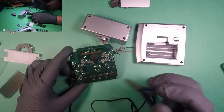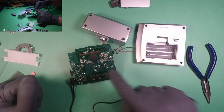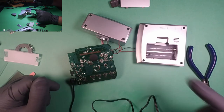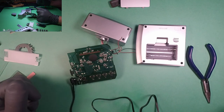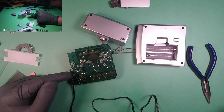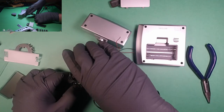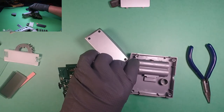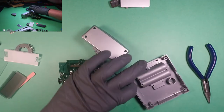There's no 1.5 volt regulator in there. So short of putting a regulator in there, what I'm going to do is run this off one battery for the clock. I mean, the current draw on that is so minimal, this battery will last 5-10 years. And I'm not going to put two batteries in here. I'm going to run this line right off the main input. Or actually, maybe what I'll do is run it off the same power source as the projector. So in the meantime, let me unplug this. Let's move that wire around now. And just be done with it.